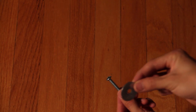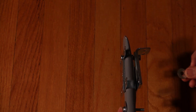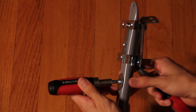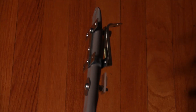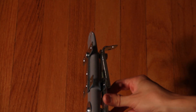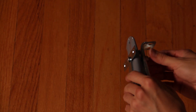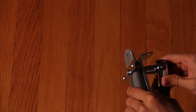Take the one and a half inch long quarter-inch diameter round head screw, attach a quarter-inch fender washer to it, then put the screw through the second hole in the jumbo arm hook. Take a quarter-inch cut washer plus two quarter-inch nuts and thread those onto that screw. Use a wrench and screwdriver to get those nice and tight. Take one of the plastic inserts from another door bracket and push the bracket all the way so it's pushed as far against the screw as possible, then secure with a nut. After securing that door bracket, push the first door bracket into place right next to the second one and tighten both nuts securely.